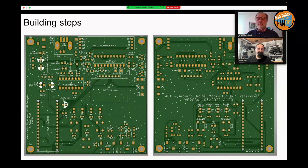On the other side, we have a five LED interface and three switches, as you see. Two of the switches are changing the modes and bands. And the switch at the bottom is the TX switch, so it's just to transmit without using WSJT-X or anything, for testing the rig or for tuner tuning facilities. On the top, you can see the four modes it operates, also the four bands. The LEDs have two functions: they can show which band is selected or which mode is selected.